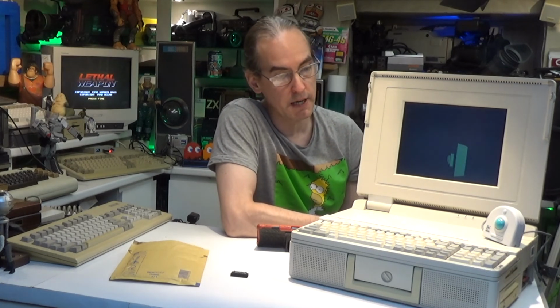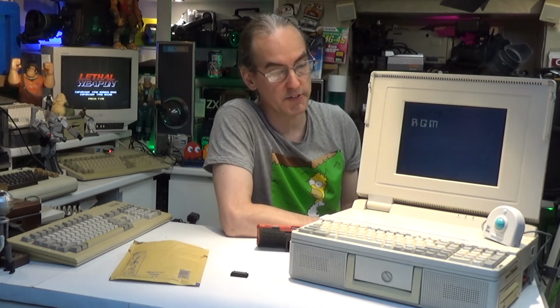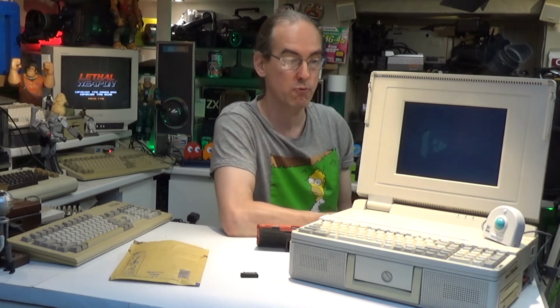It's good that the BIOS is seeing it now. I'm not getting that BIOS message anymore, which was quite frightening actually, because I've seen that message before on one of my Toshiba Libretto CT70s, I think it's that one, which only pops up occasionally. So now that that replacement chip's installed, it's actually booting with it in, but I'm not seeing any difference in performance. I did try changing the jumper settings. I just did it one way, they're all to the right, I changed them all to the left, to 3 I think there was, and it made no difference whatsoever.